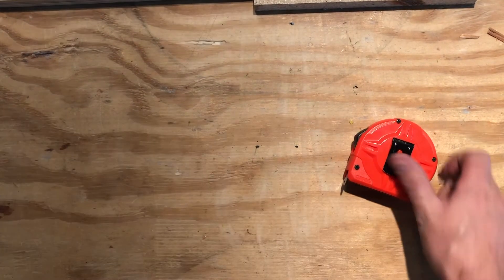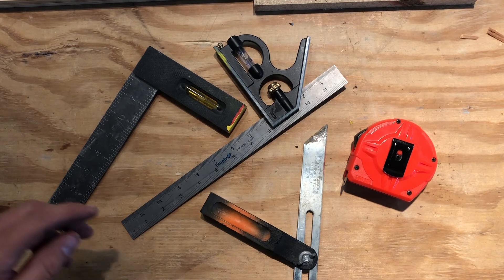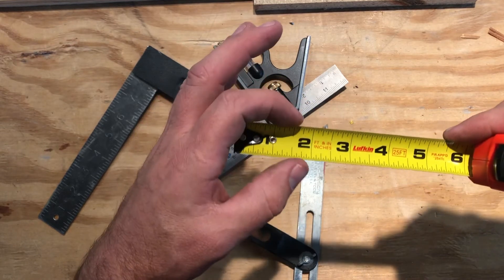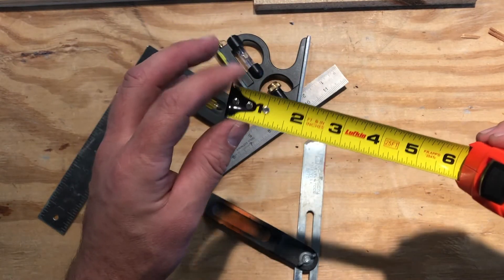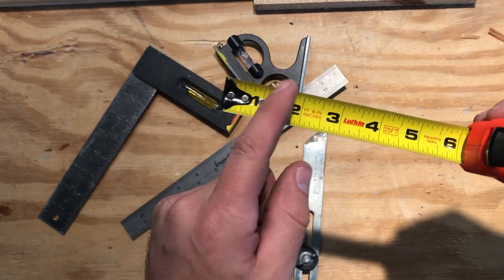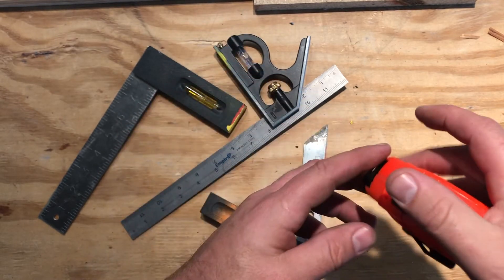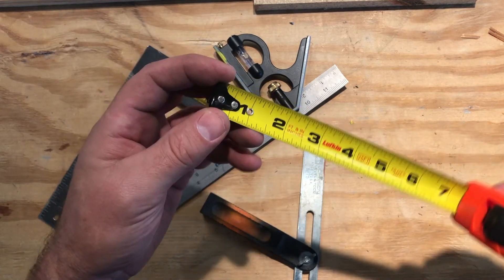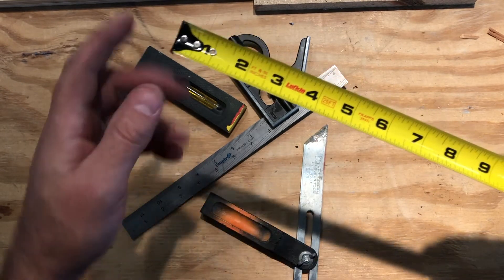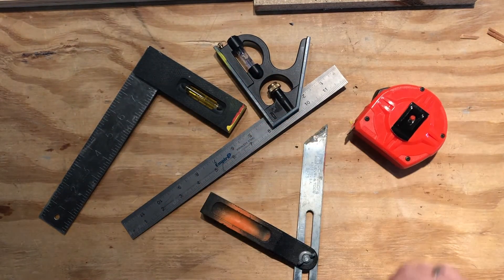And finally, let's talk about measuring things. We have lots of different tools for making measurements and making right angles. This is a tape measure — everybody should be familiar with that. This is the kind I like because it's inches on both sides. Sometimes you'll find a tape measure with centimeters on one side, and that can be fairly useless in the shop. One thing you're going to have to know is your fractions. Being good at carpentry means being able to read a tape measure and immediately say, 'that's five and five-eighths inches right there,' and then remembering how to mark that on something else. Fractions can be something that will trouble you for a bit if you weren't good at them in school.